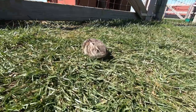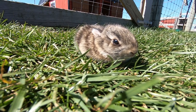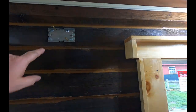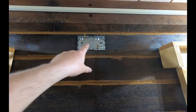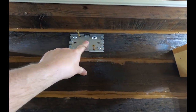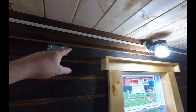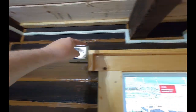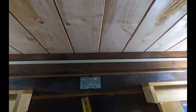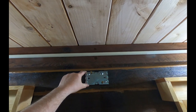We're continuing here with our wall outlets. I decided to mount these up near the ceiling because it would clutter things up too much down here. Remember how deep this other one was - those kind of sockets stick way out, so I'm going to go near the ceiling with these. We're going to put one here, one there, one there, and then run our channel to connect them. I have to put a corner over here, then run into the bathroom to get to the power. I went three quarters of an inch down from that beam and put in my back plates.